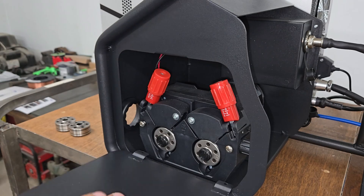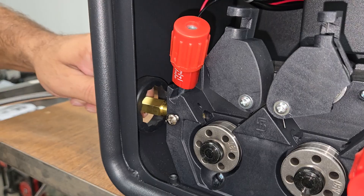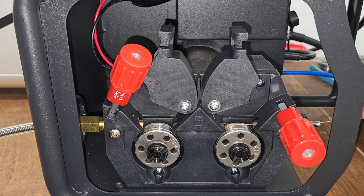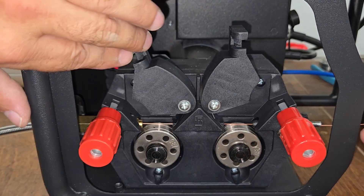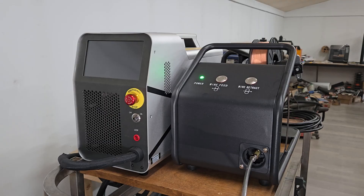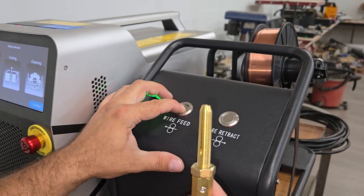This machine can accept 110 to 240 volts AC power and is air cooled with a duty cycle range of 10 to 90 percent, a frequency range of 1 to 3,000 hertz, and it can use either nitrogen, argon, or compressed air. Included with the welder in the basic kit is the wire feeder, 5 meter cables, torch nozzles, torch lenses, and laser shielded safety glasses.